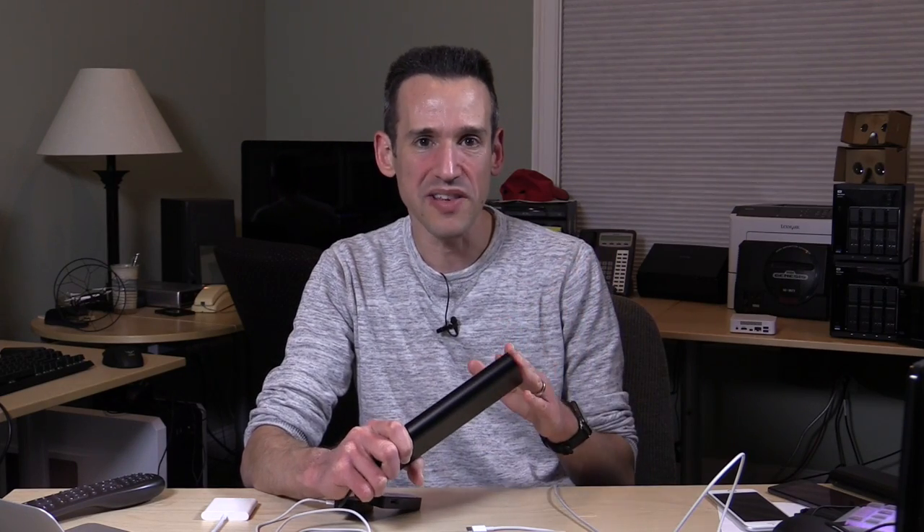One thing to keep in mind on USB-C: make sure if you are buying additional cables to use with this, that you get cables certified to support higher voltages. Even though this may not provide the same voltage as your power adapter, you definitely want to buy better quality USB-C cables. I'm going to put a link below to a Google engineer's report on many of these cables — he's been identifying cables that support the higher voltages and are safe to use with your equipment, because some USB-C cables are not. He has looked at this battery and the cable it comes with, and both have passed muster with him. But make sure that any other cables you buy are safe.